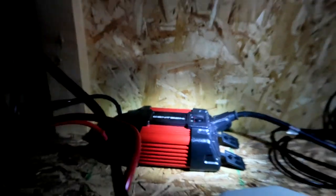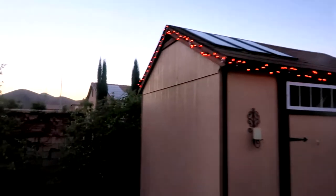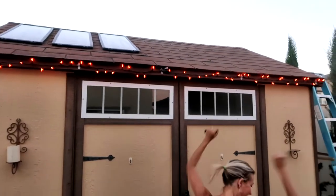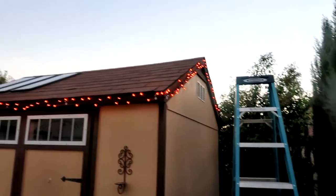It's getting dark but we've got the solar coming in from the roof. All this is extra wire from the solar coming into this hub right here, then out of the hub to the charge controller. It's actually getting a little bit of charge still even though the sun's gone behind the mountain. The charge controller is connected to the battery, the battery is connected to the inverter — turn on the power to the inverter and we should have lights. I'll just need a little timer so it'll charge during the day and the lights will automatically come on at night for a few hours and then go off automatically. You shouldn't have to touch it — it should just run and run and run. These lights are only a few watts.